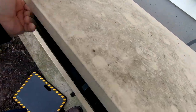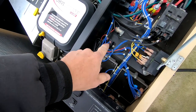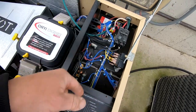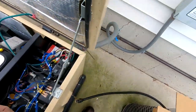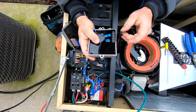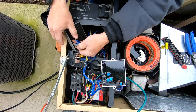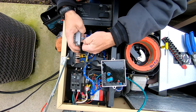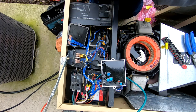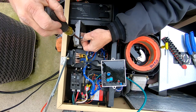This is one of the older ones. On these older units they had a separate voltage regulator, battery charger, start contact relay, step-down dual-tapped transformer. They got rid of all that and put it into one integrated control module, like Kohler was doing for quite a while. I have a feeling the fuel regulator's sticking — the diaphragm in there. You've got two sensing wires and two wires going to your slip rings, plus two wires coming in with your raw voltage. I've had a couple of these go bad and when they go bad it seems to go catastrophic rather than just fail and stop working. The problem is when you cram 300-some volts into a house it tends to blow everything up.